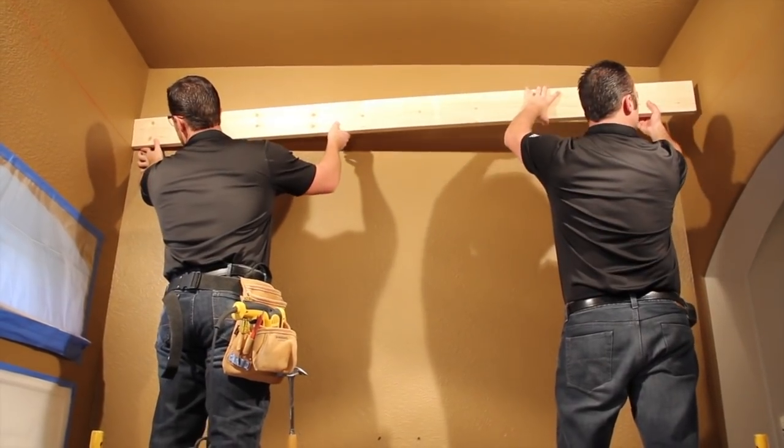As we get started in this DIY remodel, we first need to do some light framing. The steps are quite simple, and everything is spelled out for you in these detailed installation instructions. Since we're going to install our dome below our current ceiling, there isn't any need for demolition. To do this, we're simply going to fasten 2x6s 18 inches down along all four walls, and then create a 5-foot box centered in our entryway.